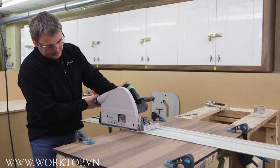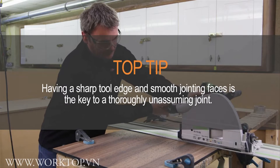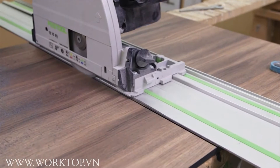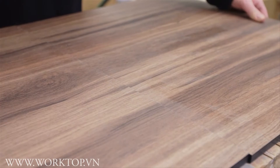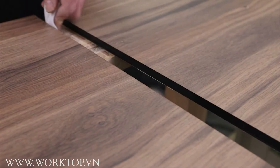Cut through the material by plunging in 3 stages of 4 millimetre depth increments. Repeat the trimming process if on dry fit chips or gaps can be seen. Ensure the cut is cleaned to allow for a good bond and finish to the joint.